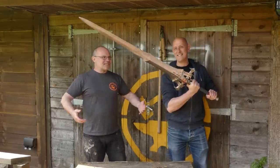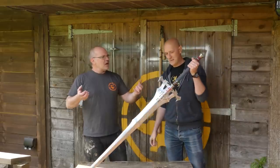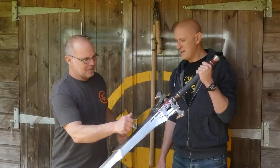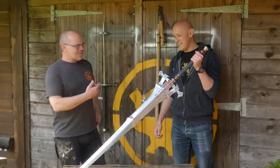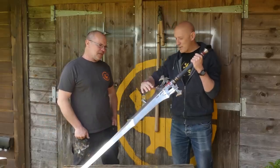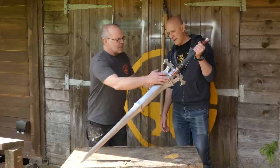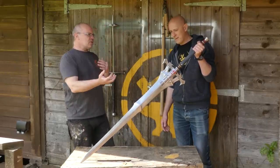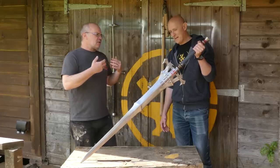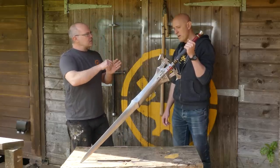The problem is this whole blade element here actually enclosed the guard, so it simply wouldn't have been possible to make it like that. I work with machinery, not handheld grinders, so I can't bolt this to a bench and work on it. For the hours required to make this thing, an 18-pound object is really hard work to process — not only am I having to hold it, I'm having to work accurately, which is really hard when you get tired and you're starting to shake. In fact, this thing's a cheat — it's hollow. Ash the armourer made that section for me. So it's kind of like a car body: a steel fabrication over a skeleton. Solid up to here, then hollow. These plates are made of separate plates, sandwiched on, layered on, and welded into place.